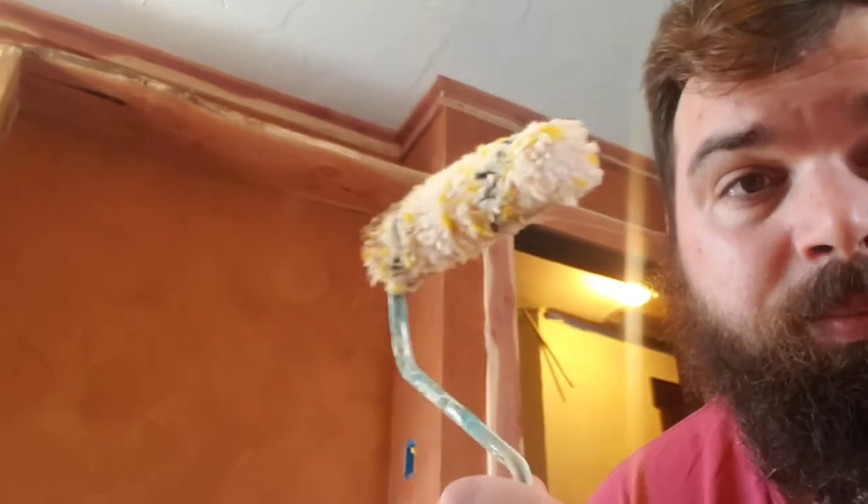I'm gonna put down a little coat. On the doors I just used a mini roller or one of the micro rollers like this. I'm going to put down a trash bag and tape it off so I don't get any major runs. The reason I'm doing this is we've got a shelf overhead and I don't want my books getting covered with red clay. For the most part it doesn't come off — it stays on the wall really well — but if it was a high-use area, like where I'm probably gonna put my helmets, that's another consideration.